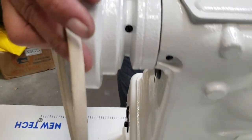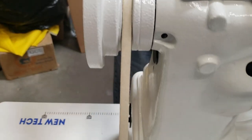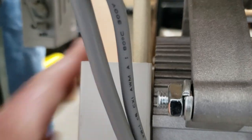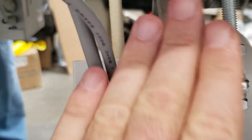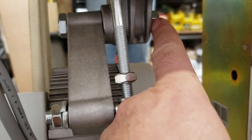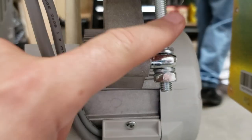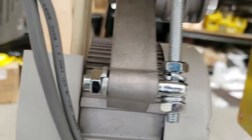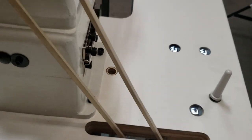Pull this back, put the head on. Now this is a little bit tight, so what you need to do is very easy: you come back here, you see this screw, you open that up and you push the motor forward maybe half an inch or three quarters of an inch and it will work out very easily. Open this up and push it back and you're going to be in business. Make sure all the screws are tight after you're done.